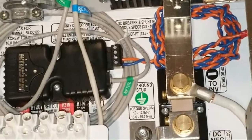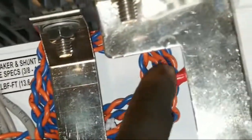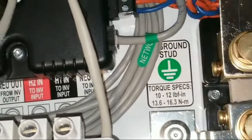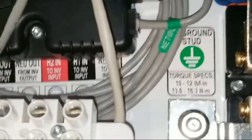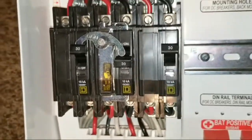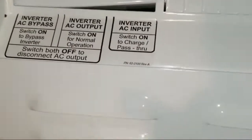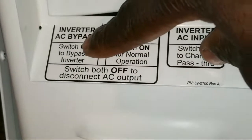This is the inverter where we put everything together. The communication is already hooked up here, and these are the sensing wires — they have two terminals that will attach to the buses so the monitor can read the load side. These are the AC breakers. Looking at the cover, this switch right here is a 30-amp bypass switch.